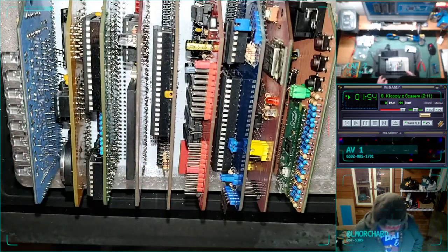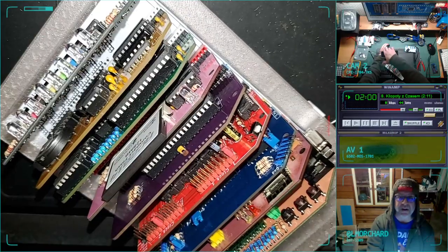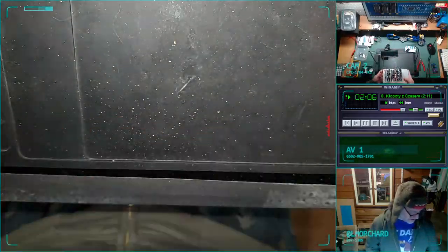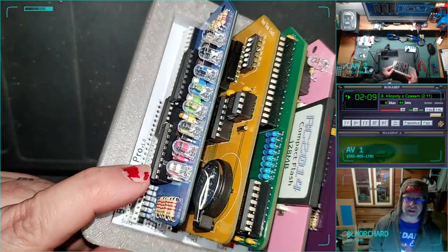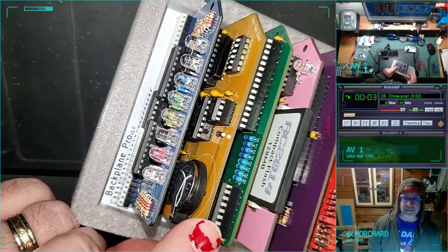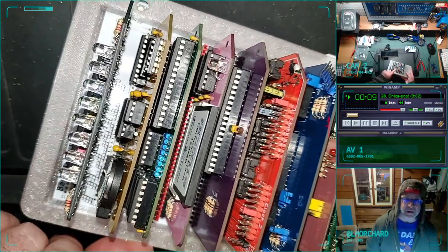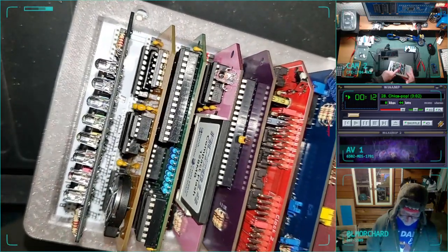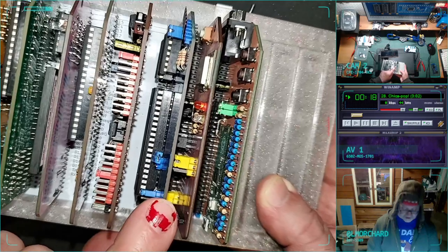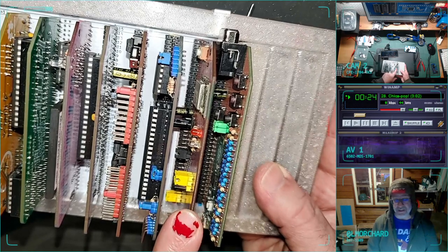You get that in the right spot? Yeah. So the peripherals here, to give it a quick tour, you can cut it. This is a very close-up view, but let's see. This is just a general blinking lights and pushy buttons I/O board. This is a real-time clock. This, I believe, is the RAM and ROM board. This is a compact flash hard drive. That's the CPU, that's a clock board. This blue card here is serial. This is a Wi-Fi board. It's got an ESP8266 in it, which I think is faster than the whole computer.